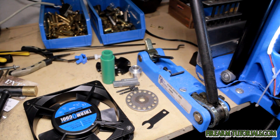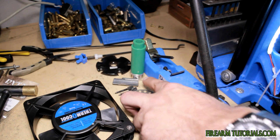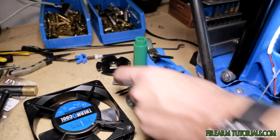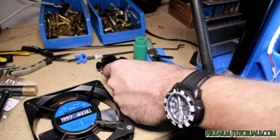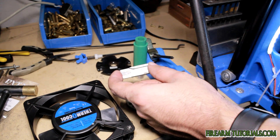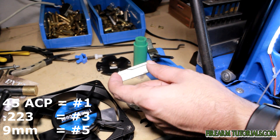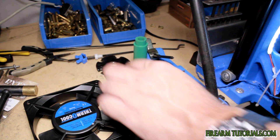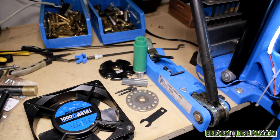Just to give you a quick look at what we're going to need to swap out here, these two components have to do with the case feeder, so we're going to have to swap those out because they're a different circumference. This number 5 is specific for the 9mm shells. While 9mm and 223 are very close in size, the 223 uses a number 3 and the 9mm uses a number 5. That's also indicated on the shell plate itself — it'll have a 5 on it just in case you get confused.